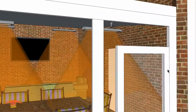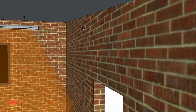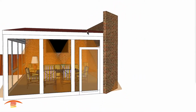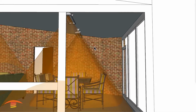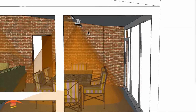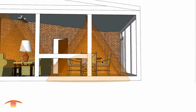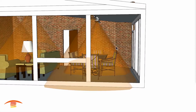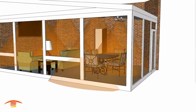And if you are wondering how come I just didn't place it on the wall over here, well, with the CD model, it's required that you meet 12 inches of clearance at an angle off of the wall, so the heater would have to come down an additional 12 inches, as well as it would have to be the same on this side here. So the heater would be quite significantly lower than what I would really like it to be. This particular side is a little bit lower than it should be ideally, but with a control system or a duplex switch, that would help minimize the intensity when it gets just a little cool instead of really cold.